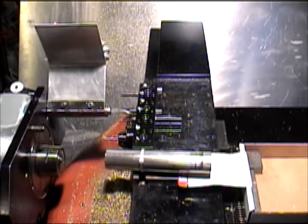We're going to do the second operation on these little Cricut bearings. I'm using four tools. I've got to spot drill it, drill it, and then ream it to 126 thousandths. I already owned an ID boring tool and had the right size for the snap ring groove, so I mounted it upside down to turn the OD. I have to run the spindle in reverse, so the start of the process is to run the spindle in reverse, cut the ring groove, and profile the part.